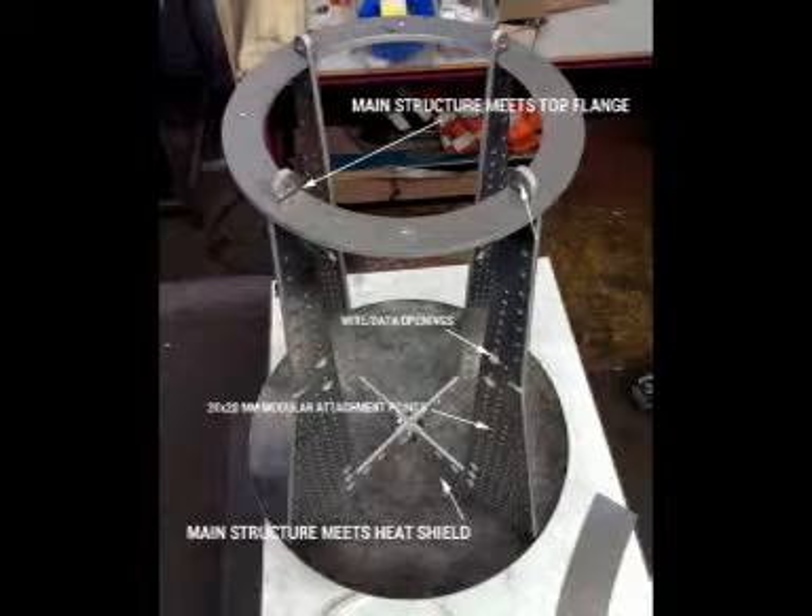Finally, getting the pieces gives a special feeling. CAD drawings and sketches are no match for the real-life physical manifestation of objects. Even though the laser-cut parts and heat shield are professionally made with high precision, they always deviate from their measurements due to their structure and manufacturing processes. This has to be taken into account and adjusted with a hammer and angle grinder.